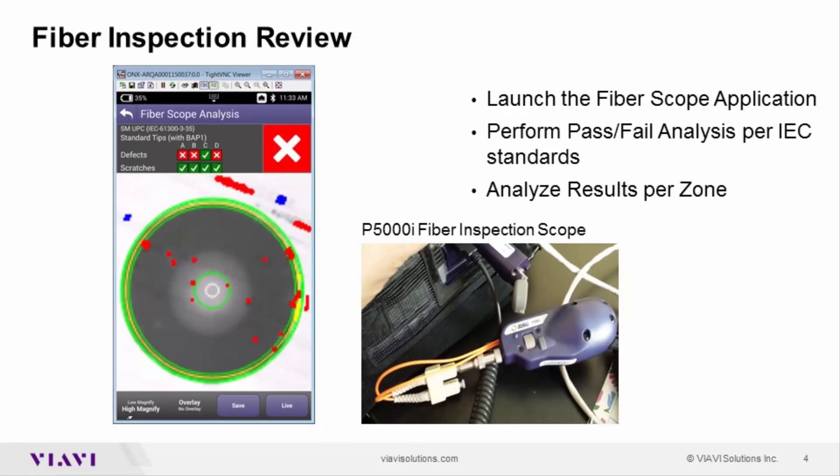From an optical inspection standpoint, if I have low RF level into my optical test point, it may be because I have a dirty fiber or bulkhead connector. Plugging the same fiber into the P5000i microscope and running the IEC standard test — and zooming in by pinching on the screen display, as the ONX is a tablet device — we can clearly see, based upon the internationally accepted IEC standard listed above and the connection type, that we inspect the end of this fiber tip. The core itself is clean but there are many scratches and imperfections in the end of that tip, which would certainly require at minimum cleaning and perhaps repolishing or resurfacing.